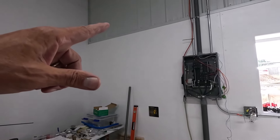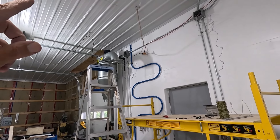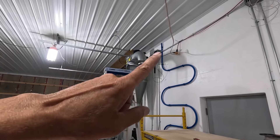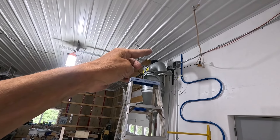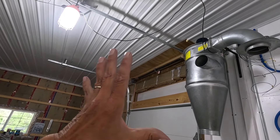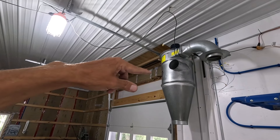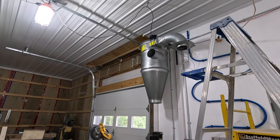For the big wires, all I've got to do is turn on the breaker and find out which ones are hot. The 30 amp stays at the pull box and that's going to get wired down for the compressor, and the 20 amp continues on to that very last box. That last box is going to get a remote plugged into it which will come over here above that pull box, and the dust collector will be connected to that. It'll be ready to turn on with a remote, but I can't turn it on as it is - not with an open end like that with no restriction - that'll burn the motor up right away.